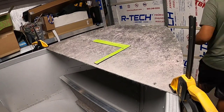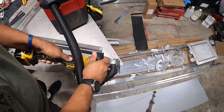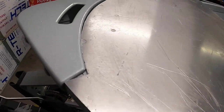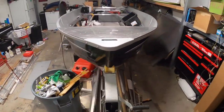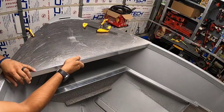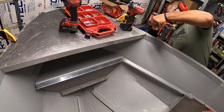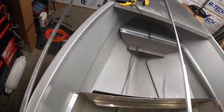This is how you handle any piece of sheet metal from anywhere — you can find sheets like this from your local metal shop, or just use a piece of wood done the right way. We used a five-and-a-half inch circular saw with the Diablo blade, which gave us a nice clean edge. Before securing it to the gunnels, we need to cut a piece of angled aluminum — a 3/16 inch piece — for absolute rigidity, since there won't be any under-supports underneath. We installed the bow plate with countersink stainless hardware and countersink rivets where appropriate.